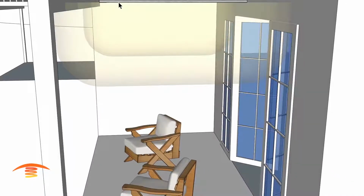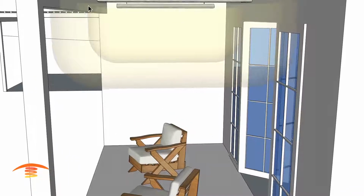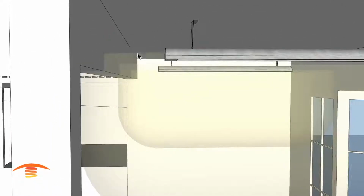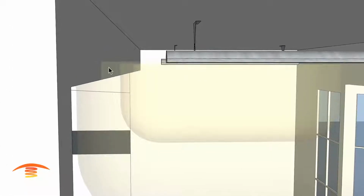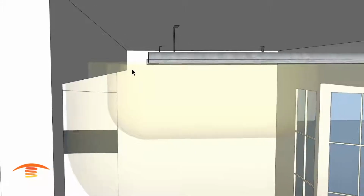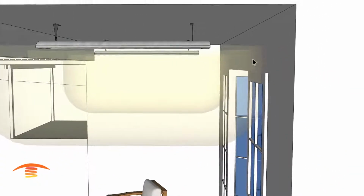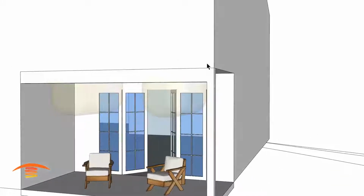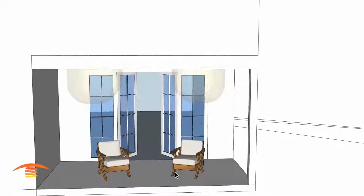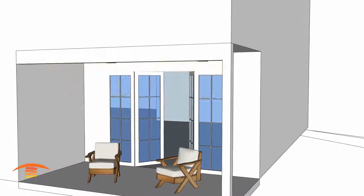Now, technically speaking, if we extend these brackets, lowering the unit so that we have this match up, sorry, I'm going to put this a little closer. This 8 inches of clearance matches up to the bottom edge here, so that the heater's bottom is at the same elevation, then that would be okay. And we pulled it out a few inches so that we can meet this clearance over here. But I actually think this is a little bit overkill. The seating area is just a casual seating area with a couple of chairs, and I think that's more than what would be needed for that.